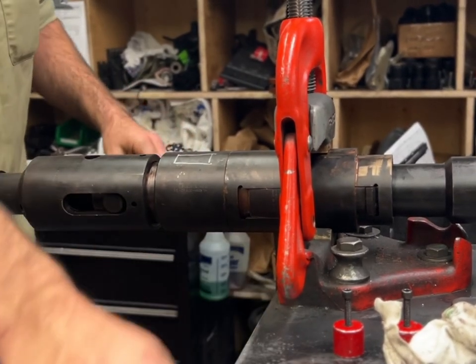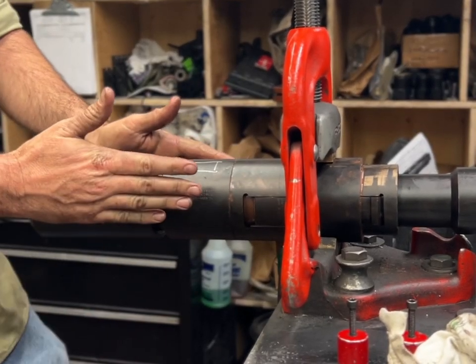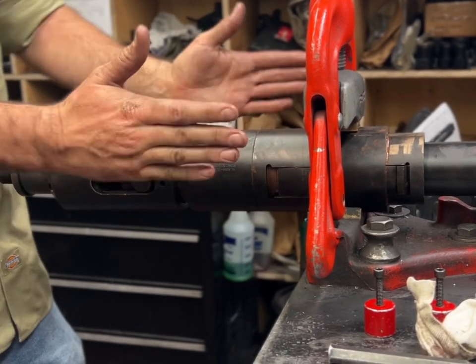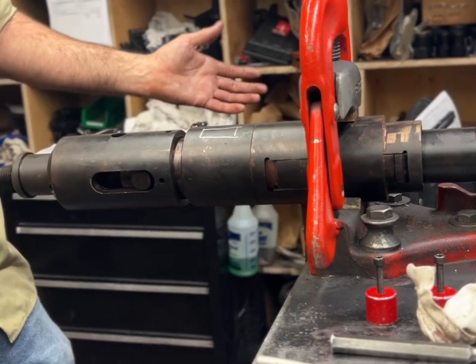Open the tool, and then push the front of the locator dogs to make sure it's latched open all the way. When it's running down hole, the nipple will catch the profile and the nipple will push the locator dogs in. Outside of the nipple, it's grease and all the thickness will stop it from going. It'll just kind of barely catch. So that's it, fully assembled.